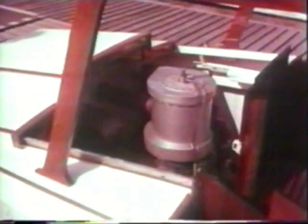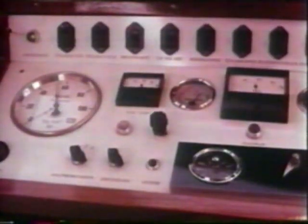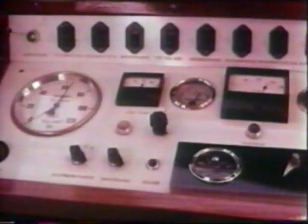The large cylinder is the preheater fitted around the head of the engine. The fuel atomizer is seen at the top. The power output of the engine is proportional to the mean working pressure. If the governor is set to a higher speed, helium from a high pressure bottle is blown into the cylinder, quickly increasing the working pressure and the power. The pressure also controls the variomatic drive of the blower that supplies the air required by the burner and keeps the air fuel ratio constant.